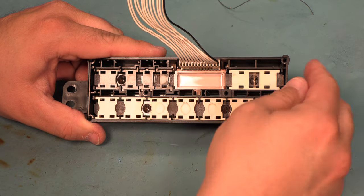We will heat the dot where we put the solder. We'll slide the transistor into place. And we'll tack each of the other two legs. Here we see the new transistors. We have a little bit of flux residue left on the board, and we're going to use some isopropyl alcohol and a nylon brush to clean that off.